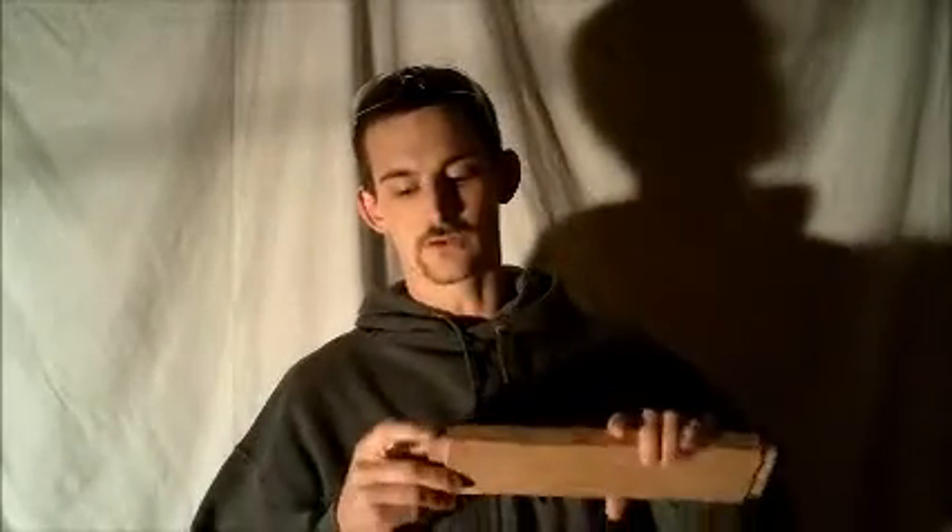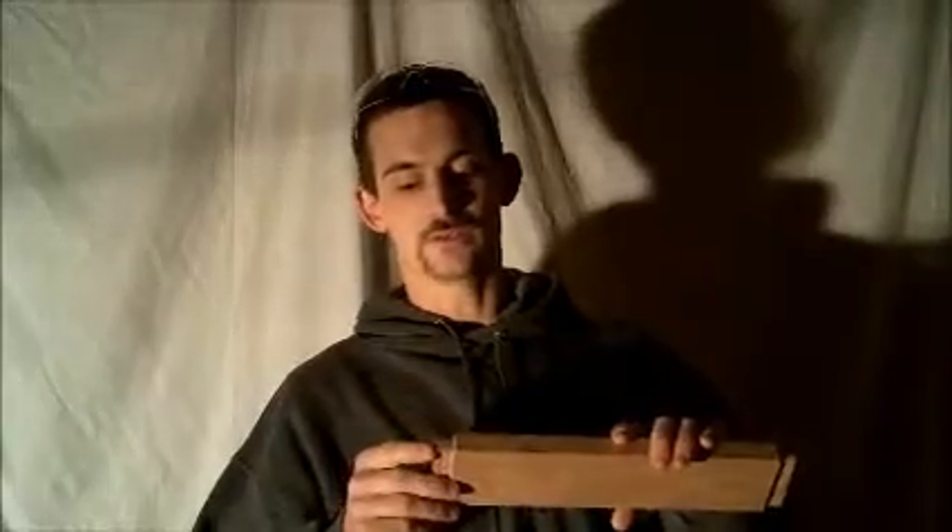It's because of the gluing surface. If you leave those grooves in there it won't hold as well — you've got less contact between the tenon and the mortise, and it'll become loose over time. If you get it nice and smooth, that whole entire surface is inside the mortise and it locks in really nice and tight. That's why you need a smooth tenon.